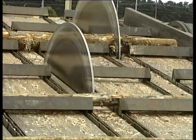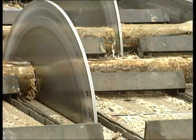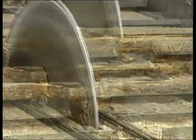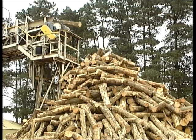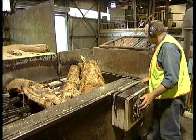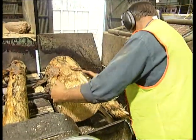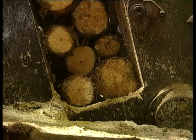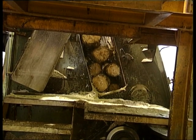Logs from the pine plantations are firstly cut into lengths that the equipment can handle. The logs are fed into the flaker, where knives cut them like a planer. We have a drum at the bottom with 80 knives, which turns the billets into a flake about 0.6 of a millimetre. The flakes are different sizes according to whether they're for the centre or the outside of the board.